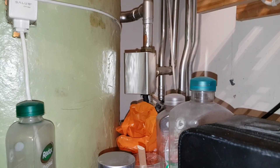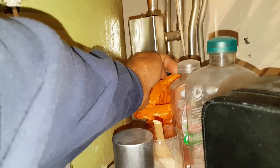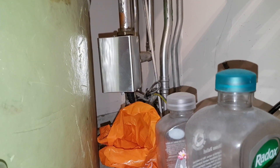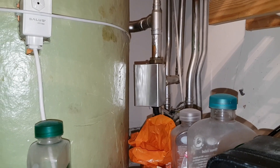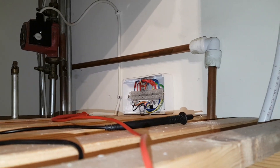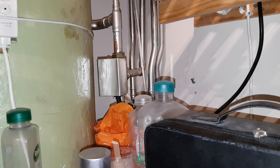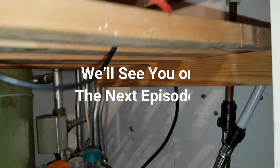It's difficult to show in here because the valve's at the back, but if I move my hand to the lever — there's resistance on it and when I let go it springs back. That means it hasn't opened, and we know there's power there, but the motor's gone. So we need a new motorized valve head — we can just change the head, don't have to change the complete body. We'll wire it back into the wiring center. That's the diagnostic done. Wasim's spotted the problem, sussed it out, learned a bit more on his electrical wiring. See you on the next episode.